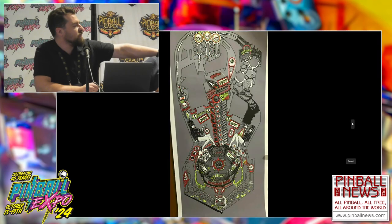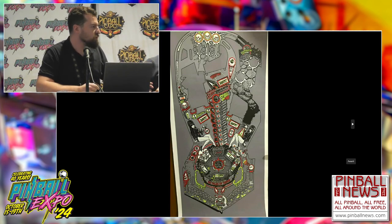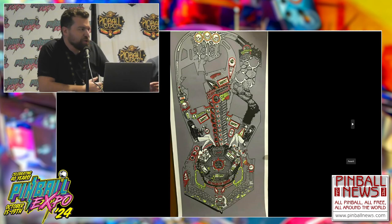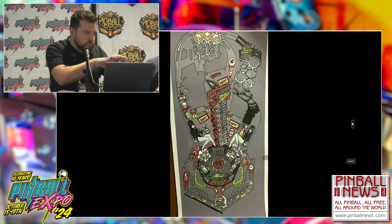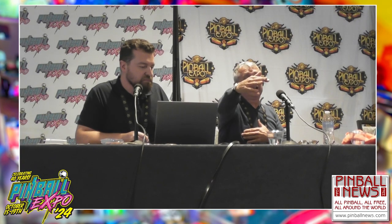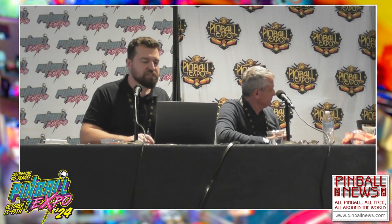We didn't do the print on plastic because we knew the dimension was right. But the first time, you have to do it on plastic so you can match it up. Sometimes it's perfect the first time, sometimes it's not, because even when you scan it there could be a little difference, and from playfield to playfield there could be some difference. We have no big scanner to do it in one time. We do piece by piece and assemble, and then with Photoshop we can merge it together.